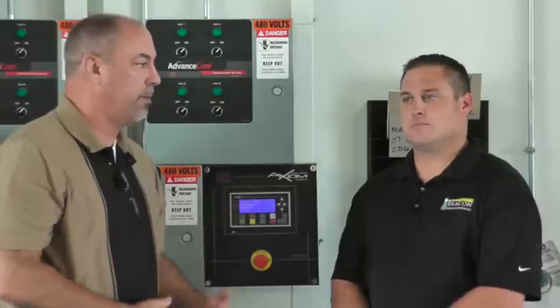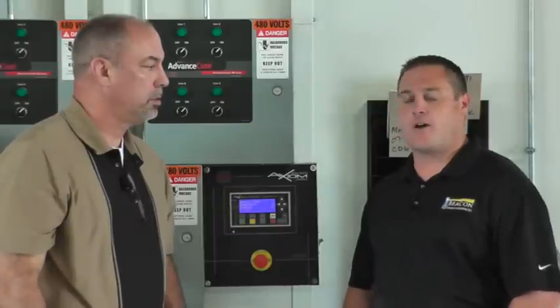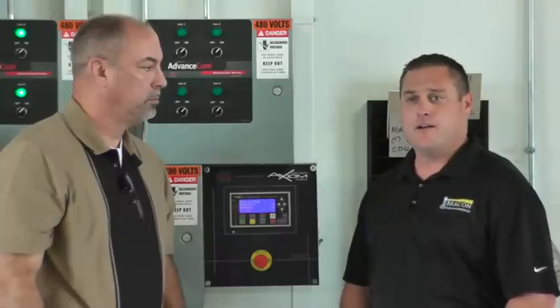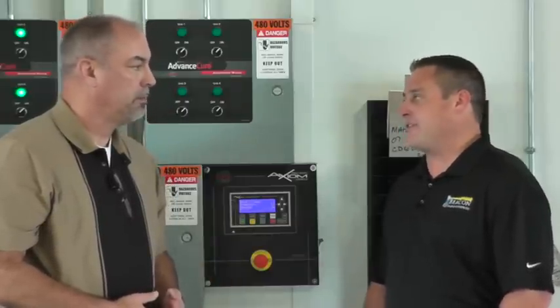Why should you be switching from summer to winter mode? In the middle of summer or winter it's not necessarily an issue, but when you get into fall and March and days start off in the 50s and afternoons end up in the upper 80s, it would be a good idea to turn the burner off in the booth to keep it from getting a 10 degree temperature rise over ambient temperature. There's no sense running a heater when it's 85 degrees outside — it's a waste of gas and additional temperature the painter is going to have to deal with.